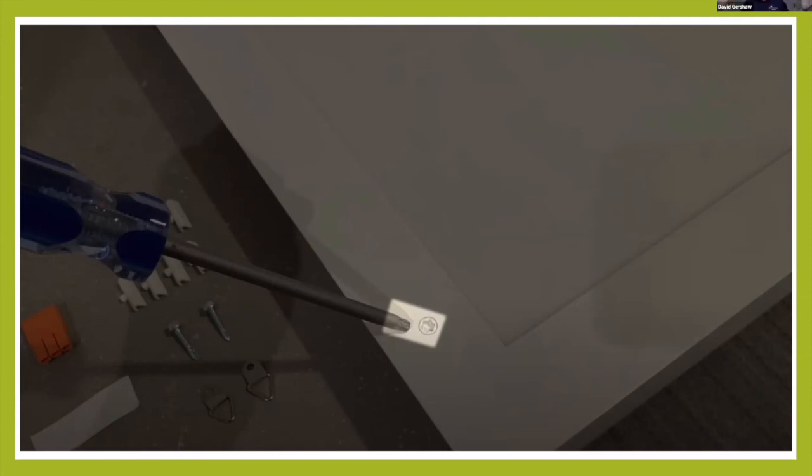So on the 2x4, you'd have your hand, you'd slide it into one edge, kind of put your hand in the middle, and then you're going to twist the mechanism on this end, and then on this end, and then in the center, and then you can let go, you're done. But we found that if you're a little bit shorter like me, and you have that flathead screwdriver, it'll be kind of at an angle because you're not going at it straight, you could slip and scratch the trim. And then we didn't want that.